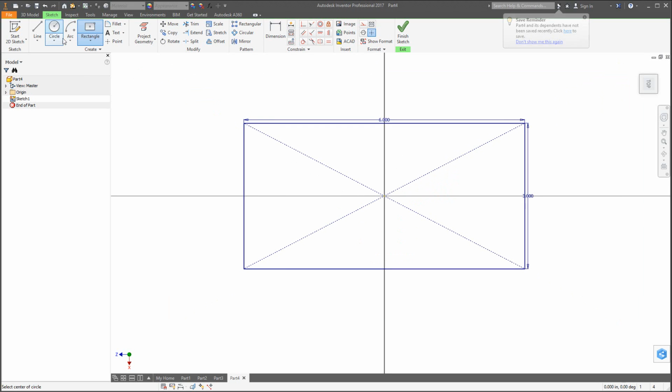Okay, now what you could do is take the circle tool and don't contact those centers. Remember from Lab 1B, you didn't want to touch those at all. Same thing here applies. Drag this out, make sure it's not touching any of the lines. It's going to be 1/2 inch diameter. Go to dimension, and dimension from the center point to this edge, 0.75. Dimension from the center point to the top edge, 0.75.